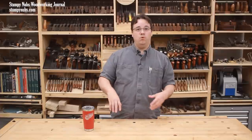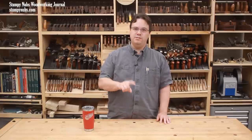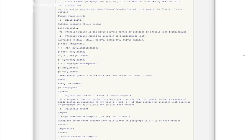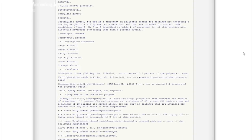Pretty much anything — because despite special salad bowl finishes and other sales gimmicks, and despite woodworking magazines that have bought into those gimmicks, finishing professionals have known all along that all common clear wood finishes are food safe once fully cured. The FDA, which regulates this in the U.S., considers the ingredients in all commonly used clear wood finishes to be safe for contact with food intended for human consumption. If it's safe for humans, it's safe enough for pets.